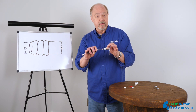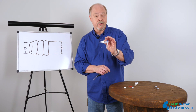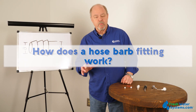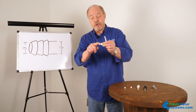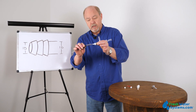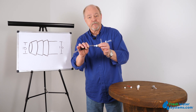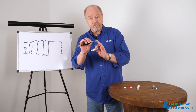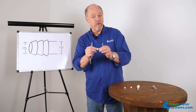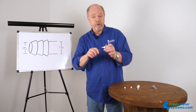Sometimes you add a little stability with a hose clamp, but a lot of times the hose barb holds onto the tube just by itself. A hose barb works by putting tubing over the top of the barb, and the barb is going to be the gripper that holds the tube in place. Typically you're going to use it with soft side type tubing, and you're not going to use this in a high pressure application where the pressure could overcome the barb's ability to hold onto the tube.